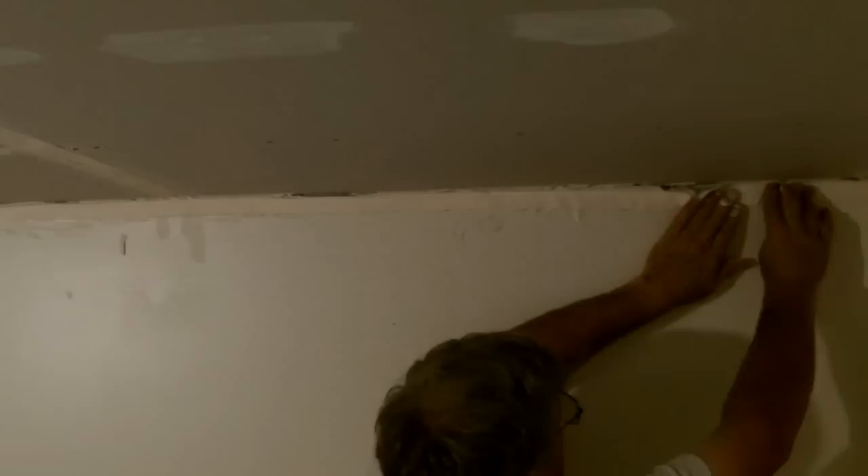When working into a corner, you may need to pull the tape back a little bit. Just do what you can reach. Flatten out each side and wipe down the mud as clean as you can get it. Remember that what you clean off today is something that you do not have to sand off tomorrow. The goal is to keep things as clean as possible.